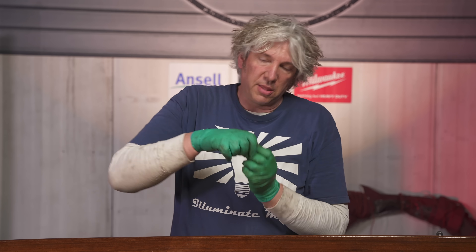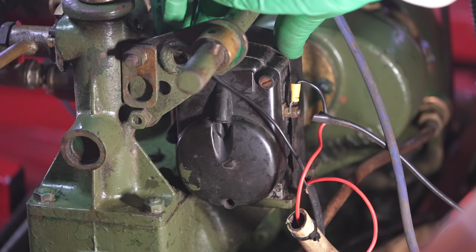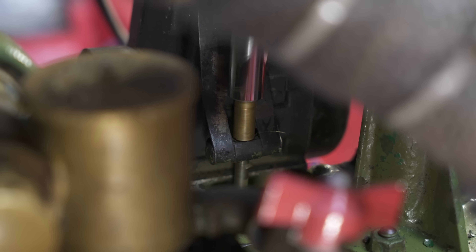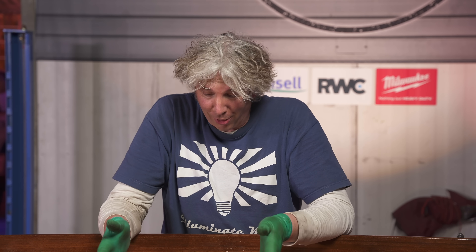Clearly, because there's an external coil here, there's obviously been a bit of a problem. So I'll just double check — take this little cover off here which actually holds the magneto down to this plinth, so I can see what model it is. There you go — it definitely says Lucas, and we've got the SR and it also says magneto, so on the right lines at least. It's probably the magneto that would have come with the engine out of the factory. So that's good news, but now we have to work out what's going on with this coil — why is there an extra one on the outside rather than one on the inside?